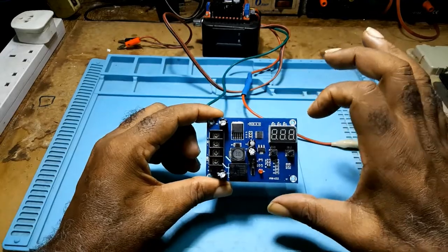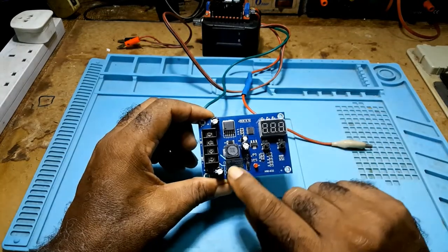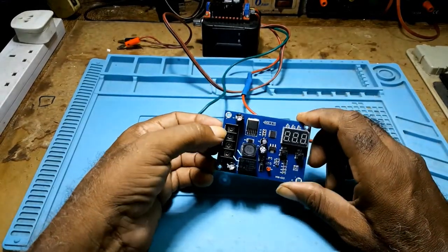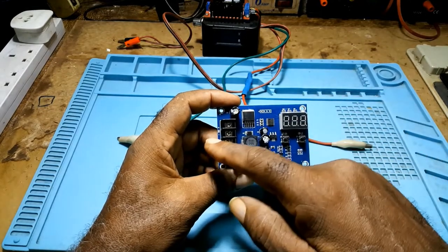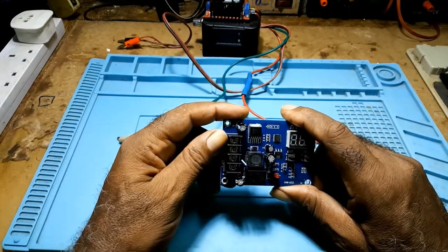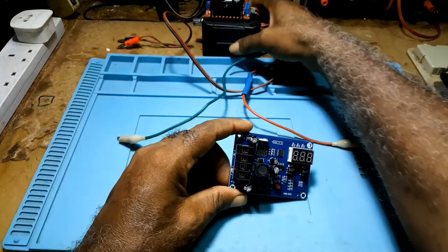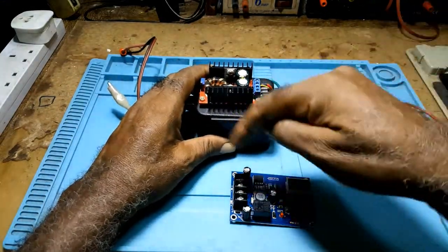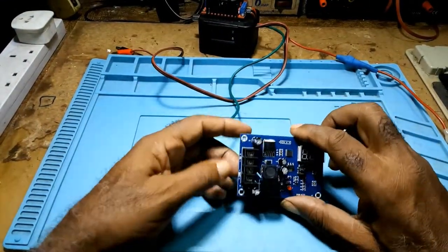I don't know all the components on this board, but I do know these capacitors, and that's the relay. When you hook this up, remember to put a diode on the positive side, otherwise current would come out from your battery and go back into the charger. If you're using a solar panel, it does have diodes to prevent current from reversing. But if you're using one of these buck converters, they don't — so put a diode here to preserve current.